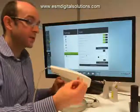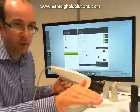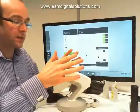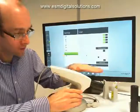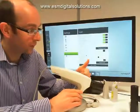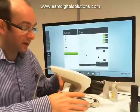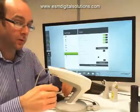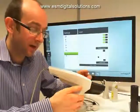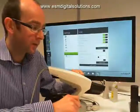When do we calibrate? We calibrate once a week — typically on a Monday morning at the start of the week. Or if there are any significant temperature fluctuations, it might be a good idea to wait until 10 or 11am on a Monday morning, particularly if the office temperature is prone to fluctuation. We want to make sure the scanner and calibration tip are at ambient temperature before calibrating. Also, anytime the scanner is moved — not just from room to room within the office, but if it's going into the back of a car and moving around, the first thing we should do when we take it out is calibrate. It takes two or three minutes and is strongly recommended.